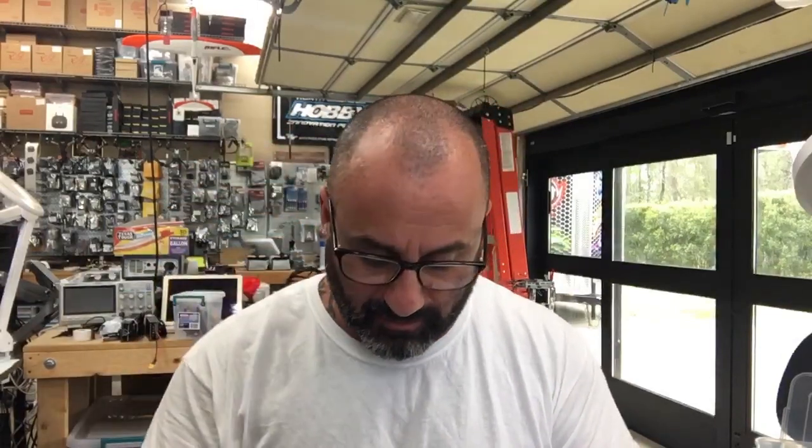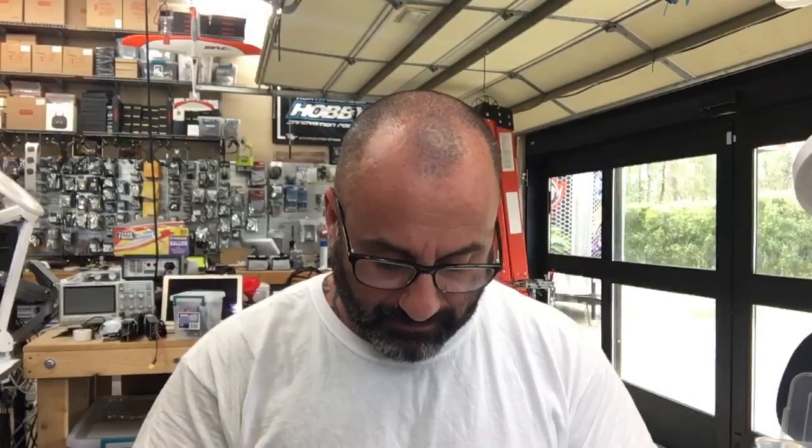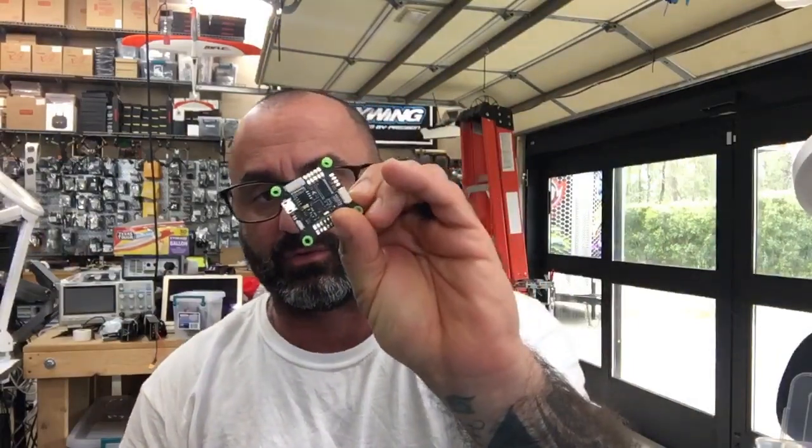These are the F7s and we've been told by a couple customers that when they plug them in to USB they've had no power at all, or that they tried to flash it and the power went out and never came back. The two boards that were sent back to me — one of these has nothing on it, it was never been soldered at all; the other one has barely any solder on it and the pads looked really clean.